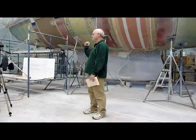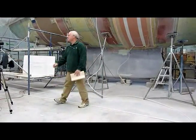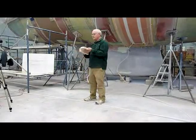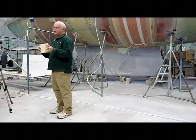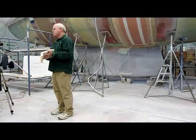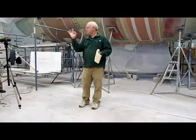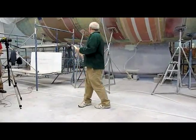You may as well do this job. There are ways around that. In production, what we do is infuse the parts so that all of the curves and all of the areas in these core areas are filled with resin, so everything's completely contained. You may actually end up with some puncture in one core area, one little block, but it will never travel very far. It might get to the next block, but it will only be a small area. It's easy to repair. The water never has any area to travel through.